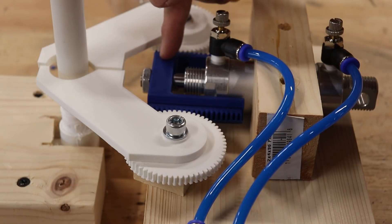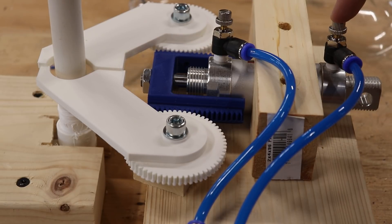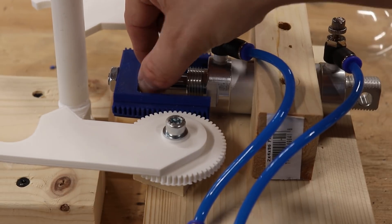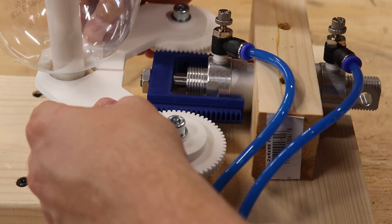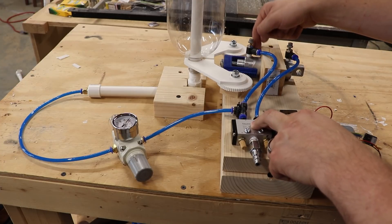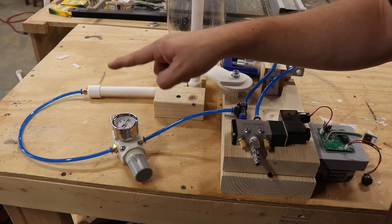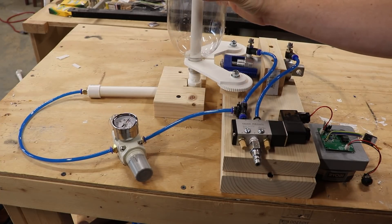I designed this piece to connect to the front of this pneumatic actuator. As soon as I turn on the pneumatic valve, air enters the back half of the pneumatic actuator and it pushes the plunger forward and opens up that locking mechanism. When I close the pneumatic actuator, the locking forks will lock that flange into place and that bottle won't be able to move up. I'm going to set the air compressor to 100 psi so the pneumatic actuator is as strong as possible. The air will travel down this path and be regulated to 40 psi with this regulator to fill up the bottle.